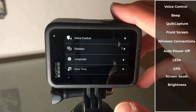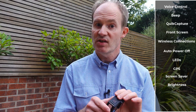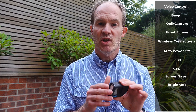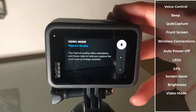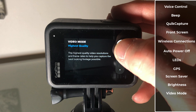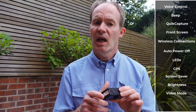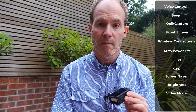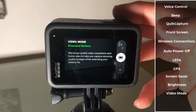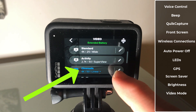Let's now go back out of the menus until you see the first settings screen again. If you've made it through the video to this point, we are now at the most battery-saving settings. Click on the video mode and we have three choices: highest quality, extended battery, and longest battery. The highest quality setting unlocks the very best resolution and frame rates available, but do you actually need them? If you're uploading to YouTube, the videos are going to be heavily compressed anyway, and most people are viewing on mobile phones and small screens. Even if you set it to the next level down, you still get access to 5.3K at 25fps and 4K up to 50fps — more than enough for most people.